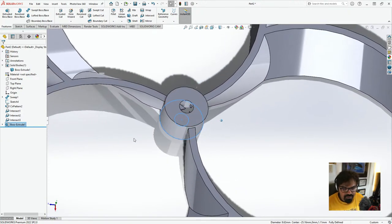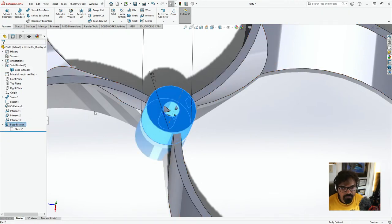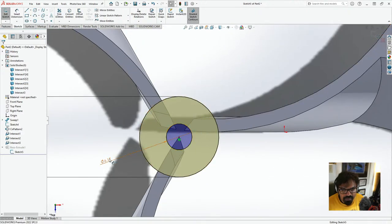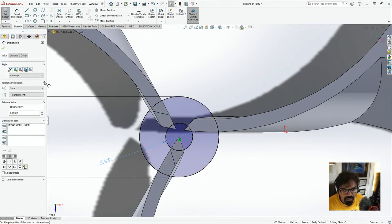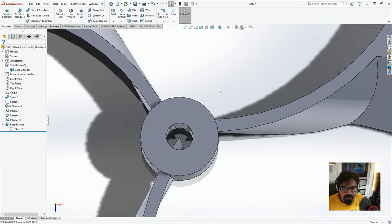Okay. And then we'll create this 4.69 thing. So we'll create another circle. So this will be the center blade. Because of dimensional issues, you know what I'm going to do? I'm just going to make this slightly bigger. Maybe some tolerance. I'm just going to put this as 6.3 or 5. Yeah, it's just, you know, 3D printing. It may not be accurate. Okay.